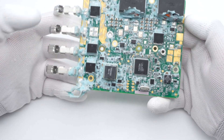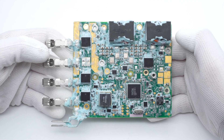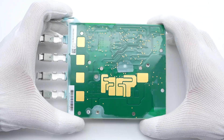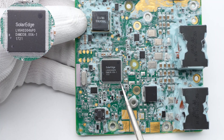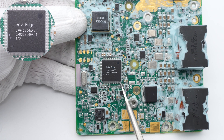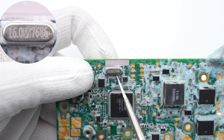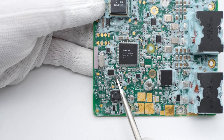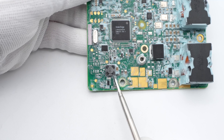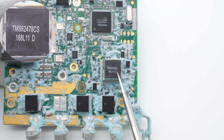It took us really long to get it cleaned up. Now we will introduce every single component. Those gold-plated pads on the back can also enhance heat dissipation. The main control chip is from SolarEdge, used for communication and protection — it can also output the signal of the synchronous buck-boost driver. This is the external 16 MHz crystal oscillator of the main control chip. The memory is from Puya, used to store firmware info. This is an external buck inductor, and here is the buck module that powers the main control chip.